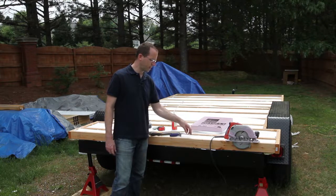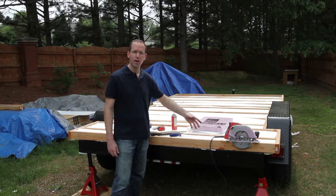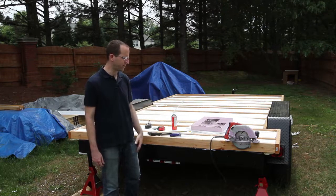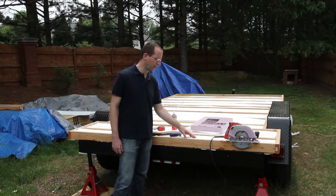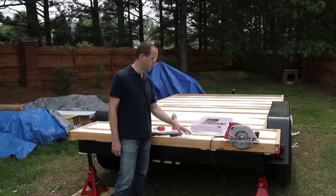Be aware that Great Stuff hardens and expands a lot. If you put down the first layer, spray it, and come back another day, you may find you have to carve out pieces to accommodate the hardened foam — it'll be easier to cut the insulation layers than to cut the Great Stuff. So definitely do it all at one time; don't try to spread this job out.